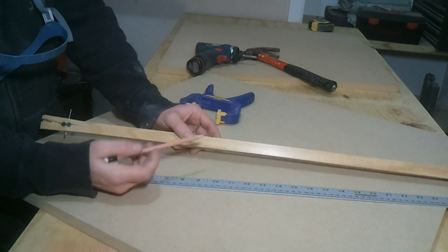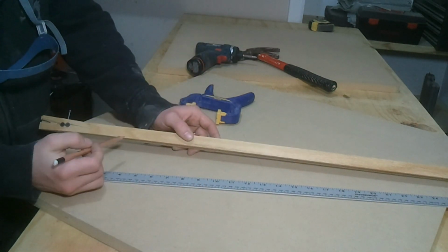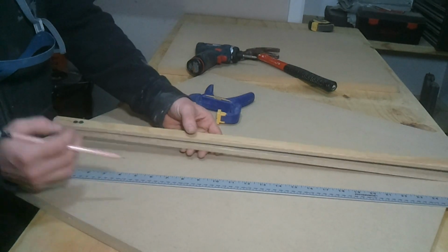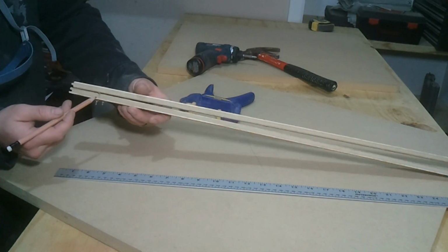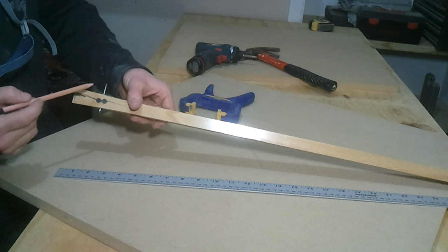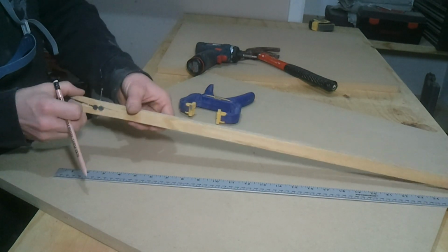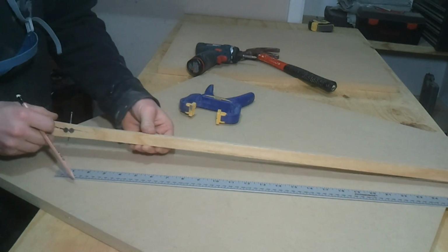So what I did is I've got two pieces of 3/4 inch by however long scrap pieces of, this is actually engineered hardwood flooring. And what I've done is I've just sandwiched a brad nail in between the two, and I've screwed drywall screws on either side of that brad nail to just pinch it in place. It split the flooring, but who cares, because it is secure and this is just temporary.